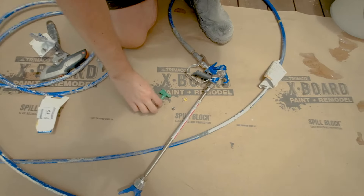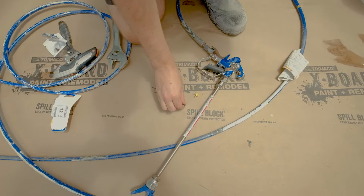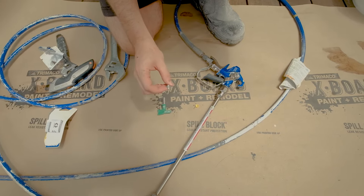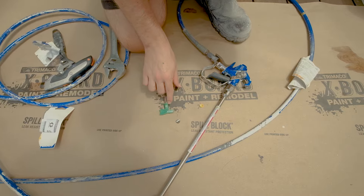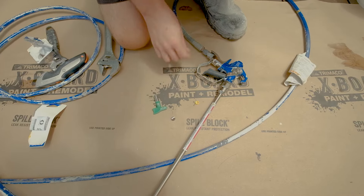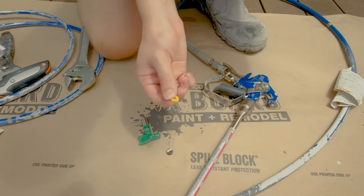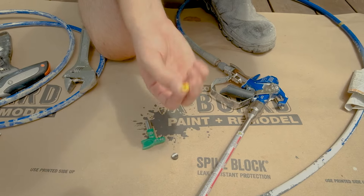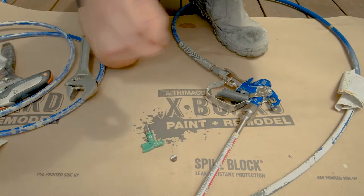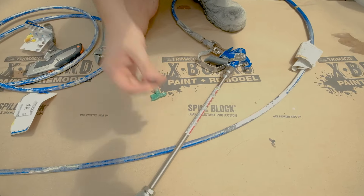There's an instruction guide in the box which I'll set aside. With the actual spray tip, we have what we call a OneSeal which fits into your spray guard — they are smaller for fine finish low pressure tips, so we'll need to change that out. This yellow hot solvent seal — keep this aside, we will not be using this. We will not be spraying solvents through a Magnum sprayer — they're not compatible. Set that aside, goodbye.